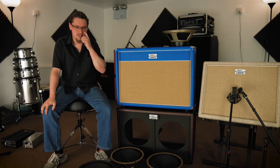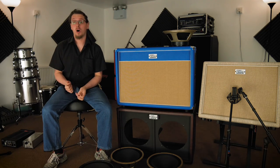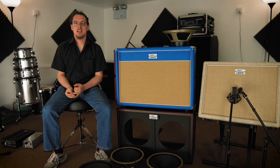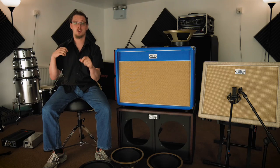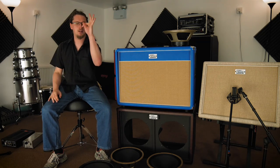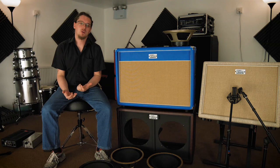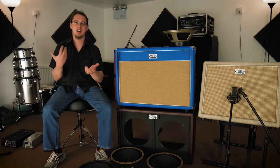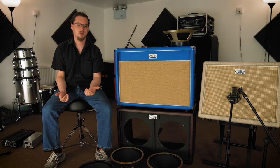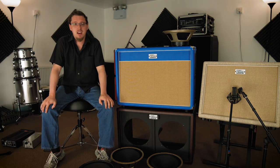Sorry about that. It sounds quite Rammstein-ish, and I figure either the microphone's clipping internally, or what could possibly be happening is that usually even quite directional microphones, when you point them at a guitar speaker, will capture maybe half the speaker overall, whereas a shotgun mic is so focused it might only be catching a tiny little bit of the speaker cone. That means it sounds a lot more like maybe just the direct out from the back of an amp, because the moving of the voice coil and all that isn't being picked up, because it's far too specific. Thought I'd give it a try, and unfortunately, that's how it sounds.